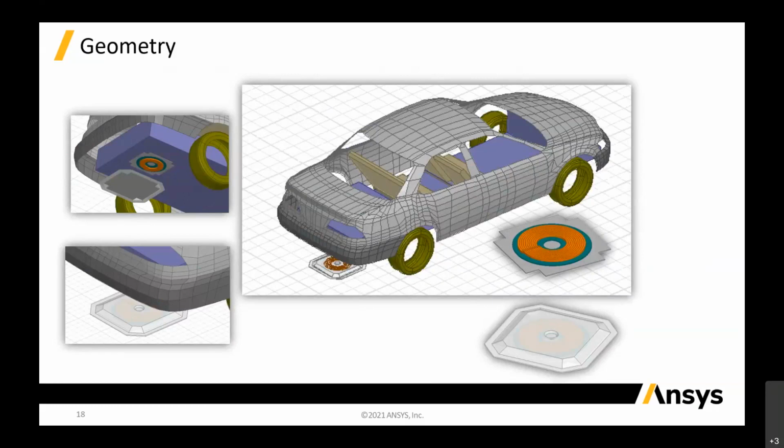So this is something we need to take note of, because between your secondary coil and the primary on the base there will be a lot of variables for a more efficient power transfer. There will be gaps between them, and that gap can be constant, but the sliding distance between them, meaning how far away the secondary and primary are, is also crucial for efficient power transfer. All this can be done in simulation to find the efficient distance between them, and the sliding distance, which is the z and y distance, to get a more efficient power transfer.